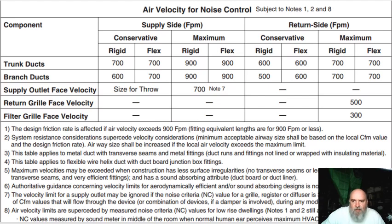There's a Note 7 — I think my mug is blocking where it actually says it — but what they're referencing is if you have runouts with 30 CFM or less. What they're addressing is high-velocity systems, and that's a guess on my part, but I believe I'm correct. To finish up on this one: supply trunks are 700 to a happy number, returns 600 feet per minute to a happy number. Size your registers for their throw — again, that's Manual T stuff, but that's how you do it.